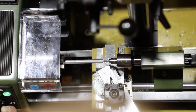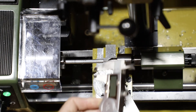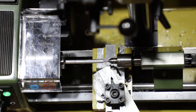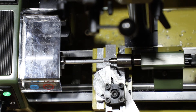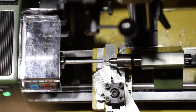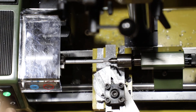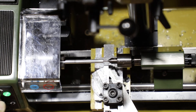This is a good place to stop and check. All of the marker we drew on here is pretty much gone. Sometimes the aluminum can warp outward, so you get a little more width than you're after. Remember, we're after about 4.8 millimeters — right now it's at 4.91mm. When we advance the compound, the aluminum gets so thin it starts to pinch and gets drawn out slightly. We want to shave off about one tenth more material. Advance the compound back to zero and advance just one tenth. Any material getting extruded out and broadening the diameter is getting cut off in further passes.